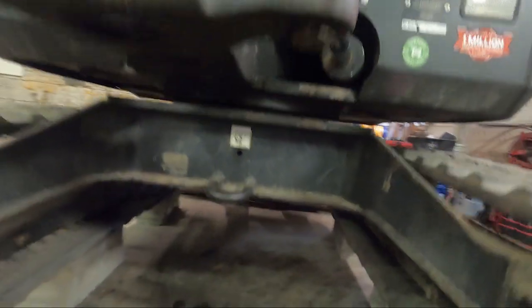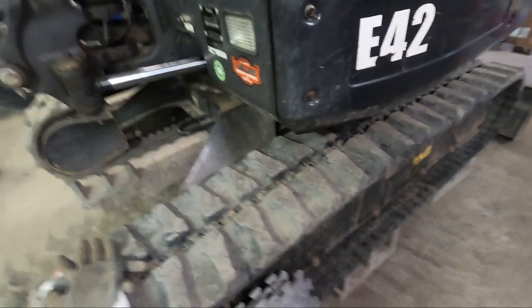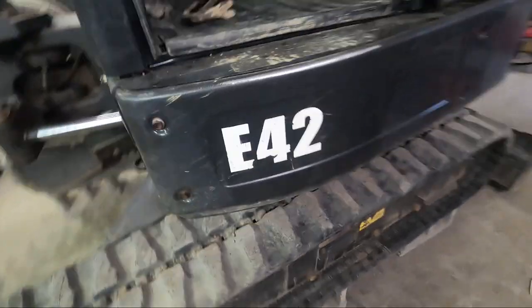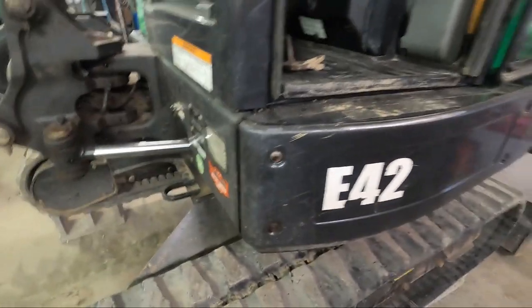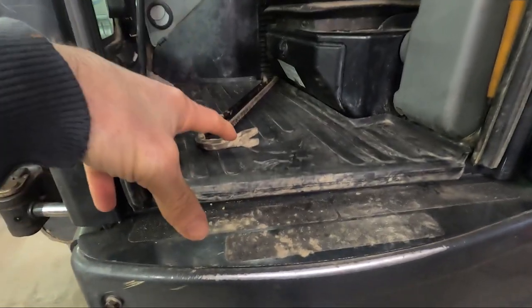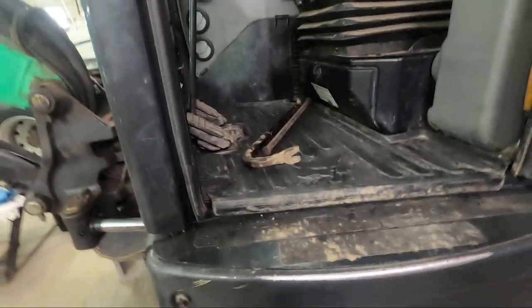Before you do those, actually, down here, there's a plate right there. Can't quite see it, but there's four bolts that hold that plate on. Take that quarter inch plate off, and from the bottom side, you can access the bottom eight hoses. So there's, I think, around eight lines on the top, eight on the bottom. Just take them all apart. And then there are four bolts that hold the swivel joint in place, and kind of maneuver it out and do your work out of the bed.